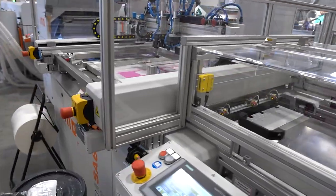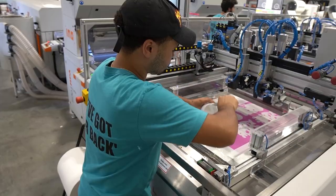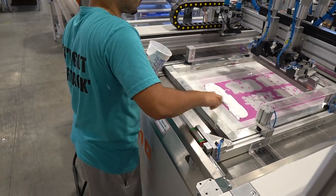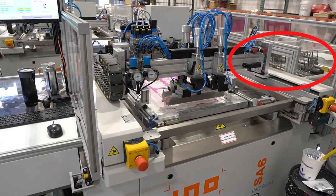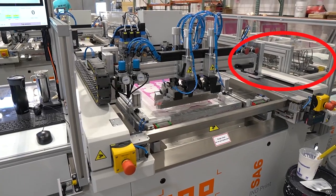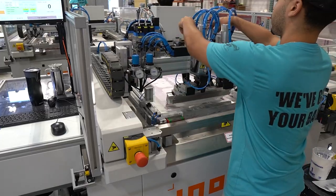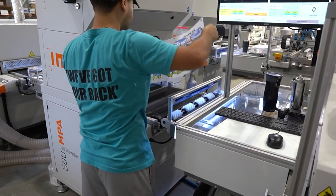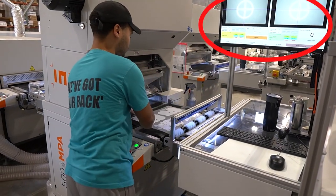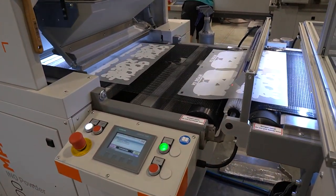Here you have the actual machine itself. The digital prints go in the beginning. Right here you have the screen that we just burnt, and now the backing is added to the actual screen itself. This is pretty much like an automatic screen printer, but instead it takes paper and film. If you look at the right side of this machine, you can see where it's going to feed a sheet of paper or piece of film through. Once the film comes through, it stops right here, and the squeegee pushes the backing down. Now he's going to check it, make sure everything's okay, and if the registration is off or anything, it is actually digitally controlled on the screen. Once he makes his final adjustments, it goes through the machine — you see where the powder is added.